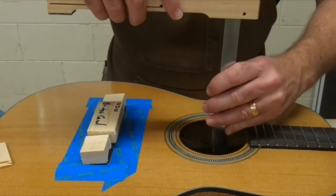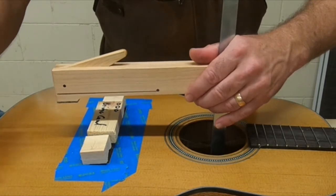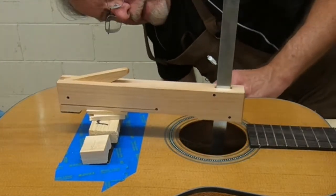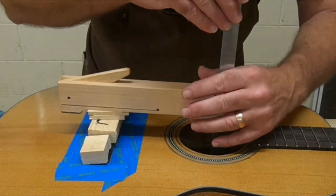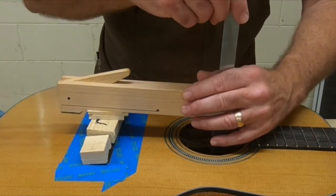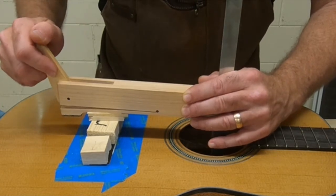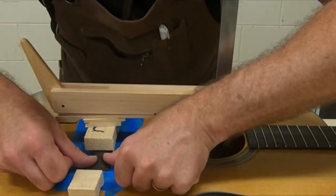So what I'm doing is I have a couple shims because otherwise it wants to tilt. It still probably wants to tilt, but make sure I got those the right way. Yes, because as I clamp down, it's gonna want to, because I'm not on the foot like it should be. So that just helps the fact that this is angling now. Okay, I'm gonna wait right there. Make sure we're still looking good.